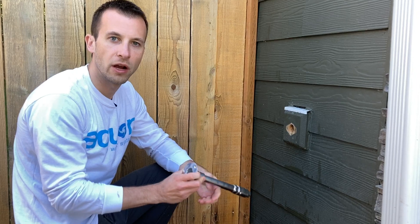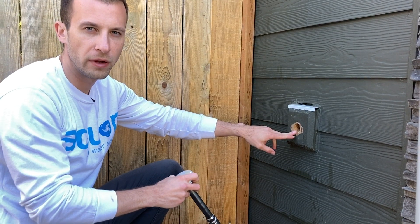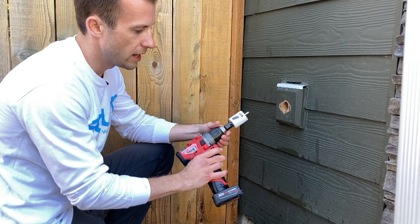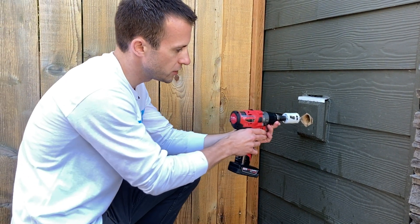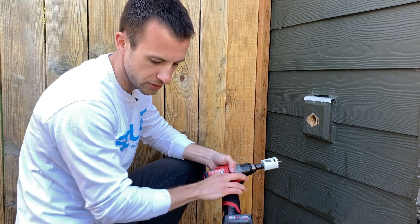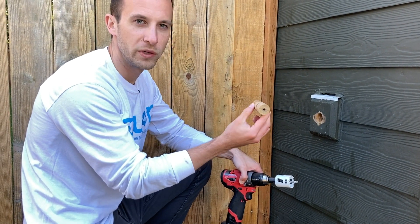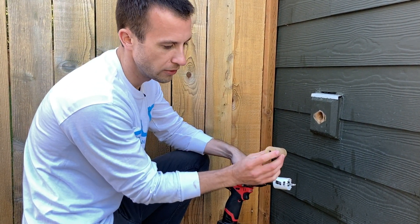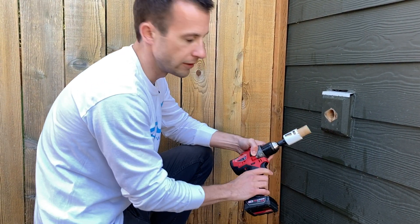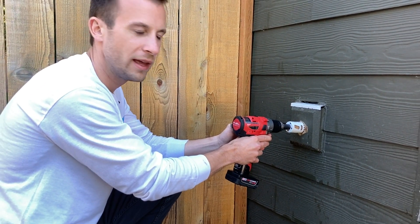Now that we're ready to put the Aukor hydrant in, we're going to need to enlarge the hole a little bit. Typically it's an inch and a quarter for a standard frost-free, but the Aukor takes an inch and a half entry hole. You'll want an inch and a half hole saw, but if you try to drill it straight, it's probably going to jump around since there's nothing for the bit to grab. A neat trick we really like is taking a wood dowel, piloting a hole in it, and then slipping that onto the hole saw so it acts as a guide to comfortably expand the hole.